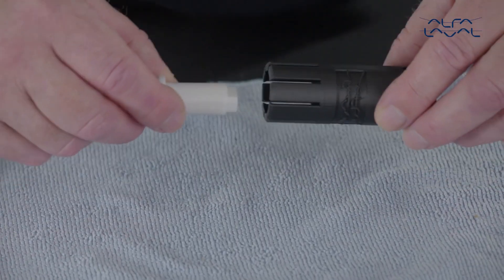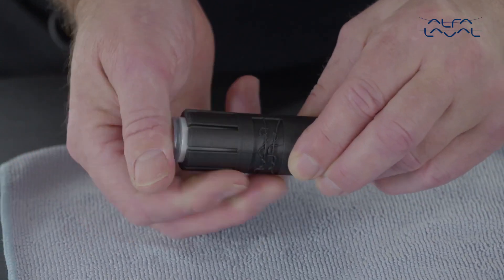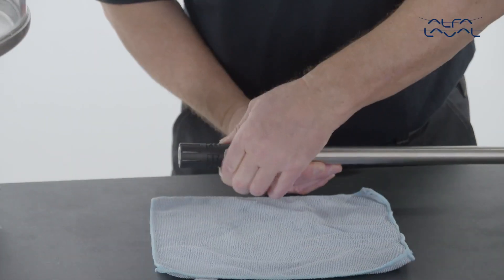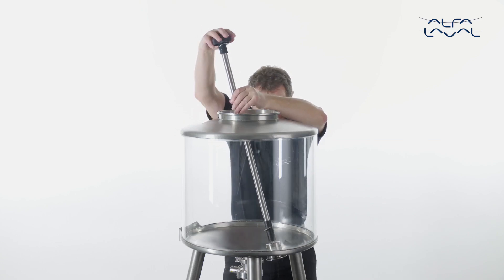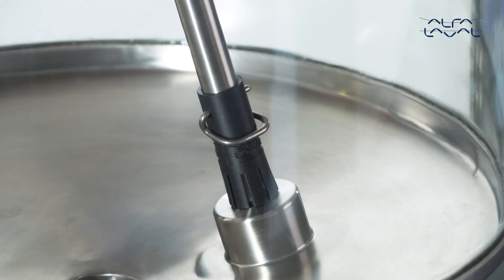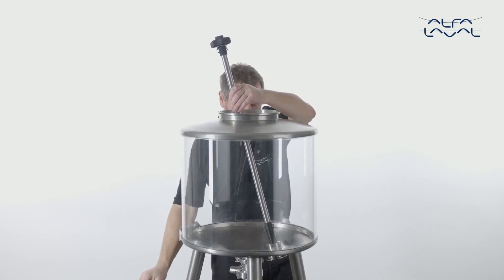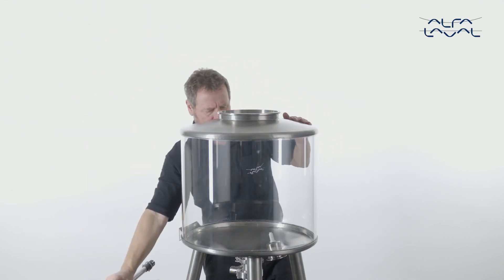Place the male bearing with O-ring in the male bearing tool. Rotate the bearing slightly by hand, enabling it to slide completely into the socket with the O-ring in place. Now assemble the male bearing tool. Use the male bearing tool to place the male bearing onto the weld plate and turn clockwise to install. Tighten the bearing to a full stop, applying proper torque for screwed connections according to the instruction manual — be careful not to over tighten. Finally, remove the male bearing tool from the bearing by pulling it upwards.